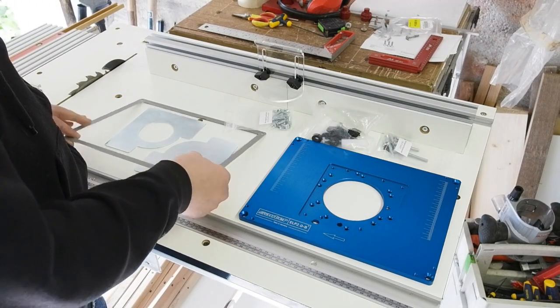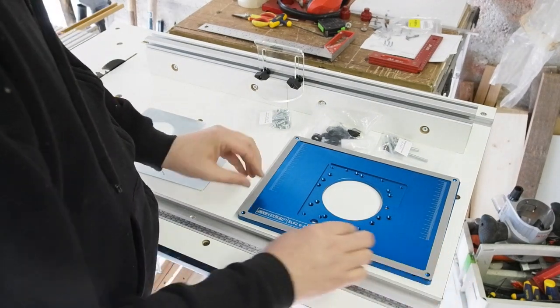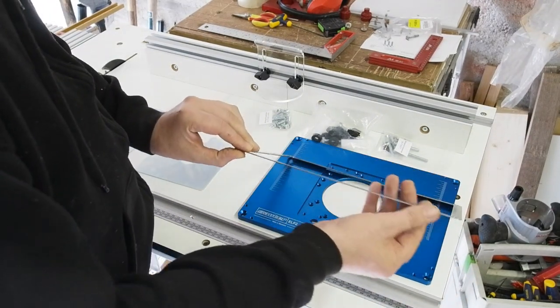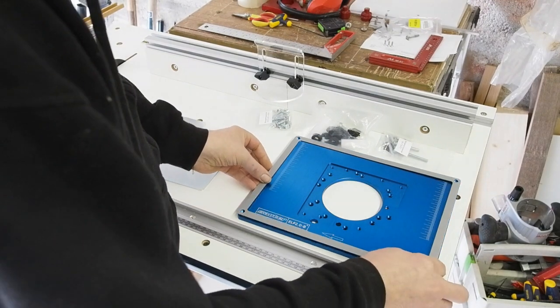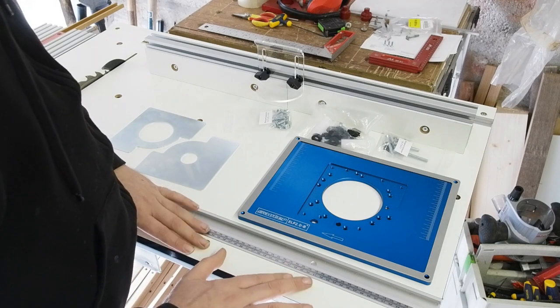On this point, a neat accessory Sorter also do are these steel levelling frames. In an 18mm surface like mine, there's only about 8mm of material left once you've routed out for the plate. These levelling frames give the adjustment grub screws something solid to bear against,